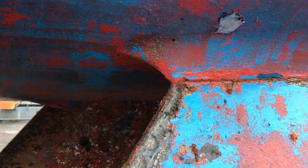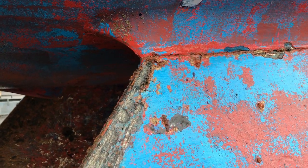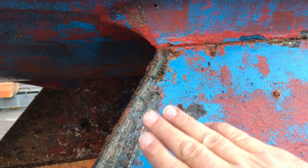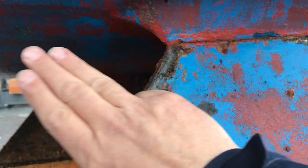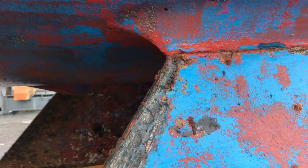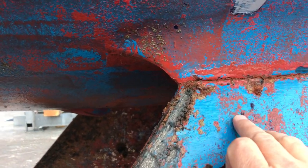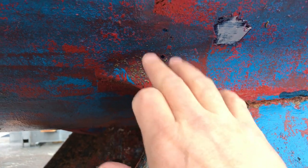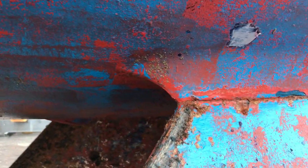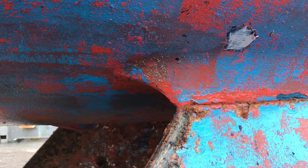It's worth having a look there, and conversely if we go along to the trailing edge of the keel — when the front edge hits something, the tendency is for the trailing edge to be pushed up, backwards, or inwards into the hull. We might see traces of hairline cracking, larger cracking, or splintered GRP here also. But this boat looks fine — I can't see any damage.